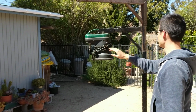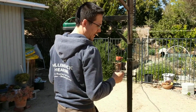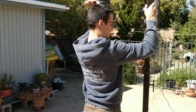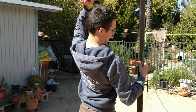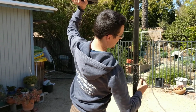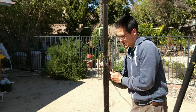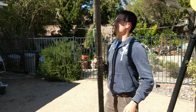Once you've got this mounted, just go ahead and raise this up to the desired height. Now, if you don't know what your desired height is, you should set it and make a mark on here so that you're not holding this heavy thing above you while you're trying to figure out right where you want it. So I have a little line mark there, so I know, oh, okay, I'm at the height I want without having to mount my down tube and check its distance from the floor. These you want pretty snug. You shouldn't need a mallet or a hammer to get them loose, but get them pretty tight.